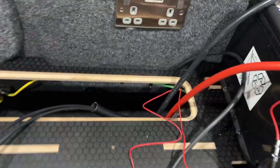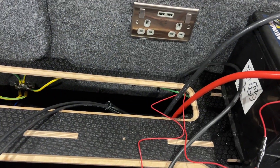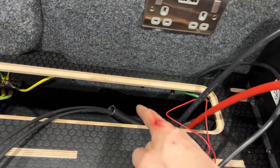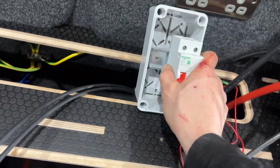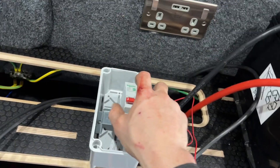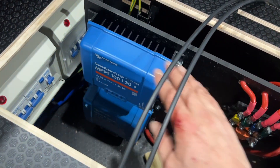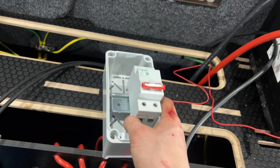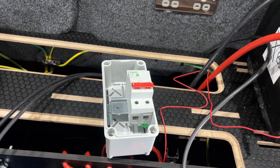I've got the solar cables coming down here, obviously going to be behind this panel, and they pop out just back here. I need to put them into this double-pole solar breaker — which is IP65 waterproof, so not going to get any water down there. It's going to sit on the wall under here, with the two input cables in the top and the two outputs at the bottom. It will then feed into the back of the board and into the MPPT. Two wires in, two wires out — just make sure I've got the right positive and negative, and that's that.